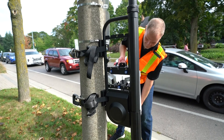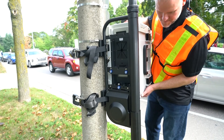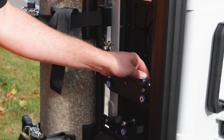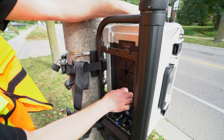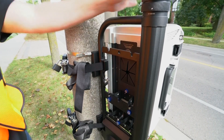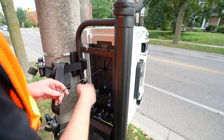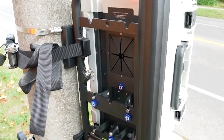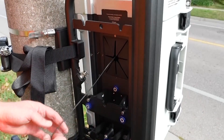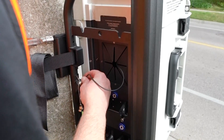Lift the VCU and place the mounting slots on the large and small cleats on the pole mount and drop into place. Now remove the thumbscrew from the parking spot on the pole mount. Secure the VCU by inserting the thumbscrew. Next, reach into the VCU's cable pocket and pull out the video patch cable — one end will remain connected to the VCU. Connect the video patch cable to the connector on the pole mount by pressing down and twisting a quarter turn until secure.